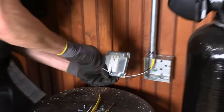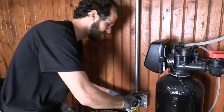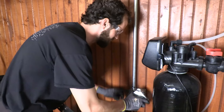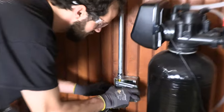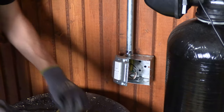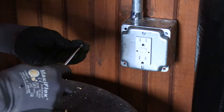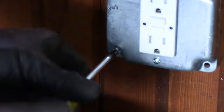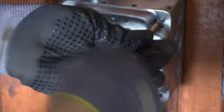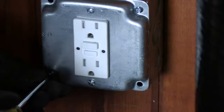Using the supplied parts with this cover plate — there are locking nuts on the backside of the screws for a really tight, secure connection. I'll fold the wires into the box and give it one full rotation. Just make sure the ground wire does not come in contact with hot or neutral. It's easy in the midst of it all to leave something untightened, so I always come back and check after the last fastener is snug. All is well.